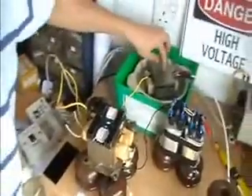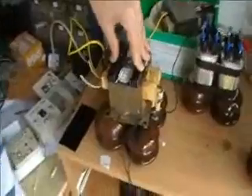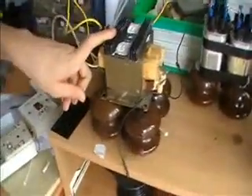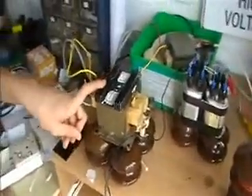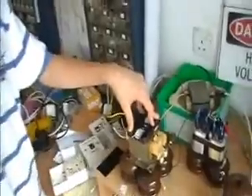The output of this is about 2,000 volts. And that comes down these wires to this ballast transformer. What this thing does is it limits the current to about 11 amps on the mains side. This also helps with the resonance circuit to supply additional inductance.